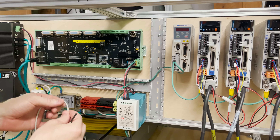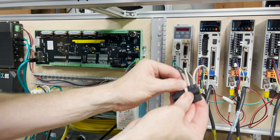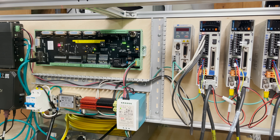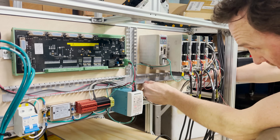Let's start hooking up some power to these servo drives. It powered on — just three more and then the small one hooks up to 24 volts. I decided to go ahead and add one more raceway right under these servo drives to help keep things a little more tidy. That should give me a spot to run the power wires up to the servo drives and keep it a little cleaner.